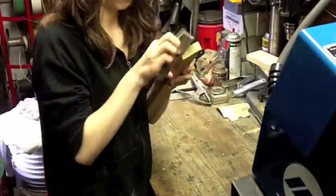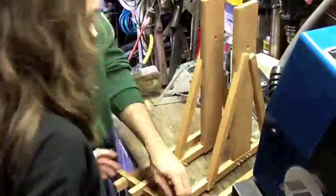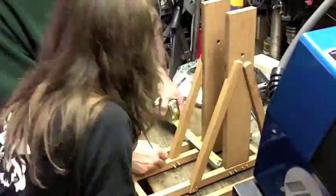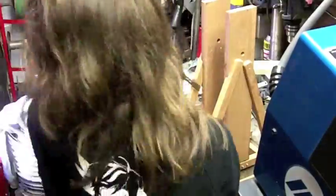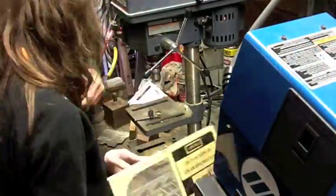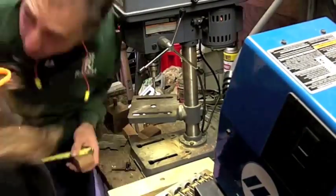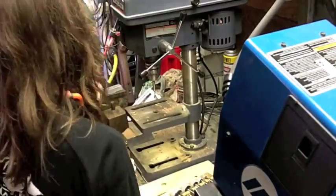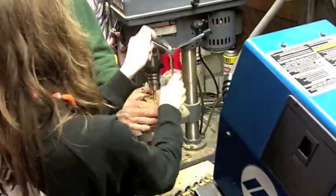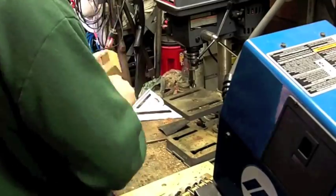She's going to get the sandpaper and sand away. That kid sanded until her fingerprints got changed. She did a fantastic job on that thing. We went through several different designs on how to keep that throwing arm centered in the frame. Two things to maintain accuracy are consistent throws and a straight arm — you need that arm straight. So the release point and a straight arm is what we were shooting for. These two blocks are the designs she decided to use — standard blocking on either side. That'll keep the arm both rigid and centered so that heavy chunk of steel doesn't whack the frame when the arm is released, and the arm throws straight and true every time.